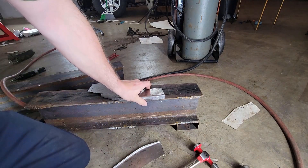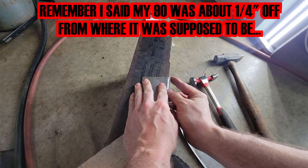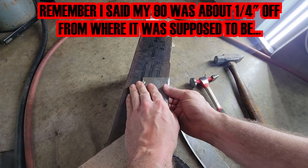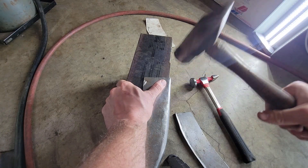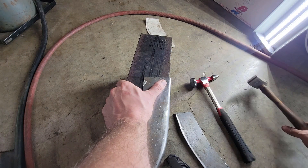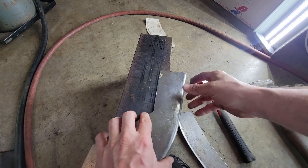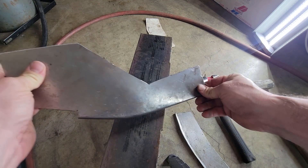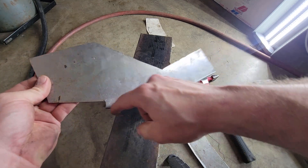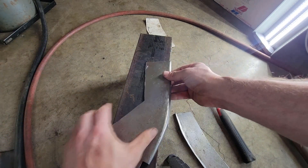Here's what I did. If you're looking down at the piece like so, and picture that it's sticking out further — all you do is choke up on the piece a little bit and then beat that down and around the corner. Each time, it pulls it up more and more. We got it test fitted in, the top all fit, all these edges fit perfectly. It was this 90 and this 90 right here that I had to massage — I had to massage both of them.